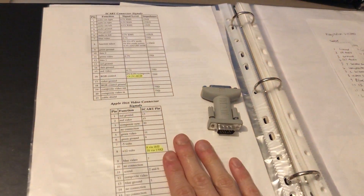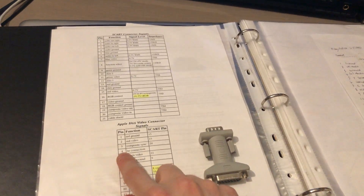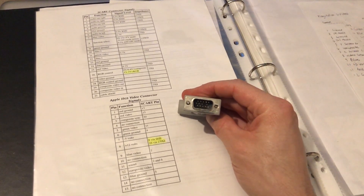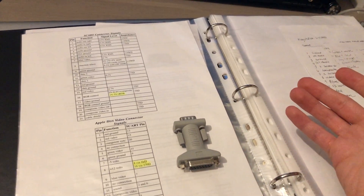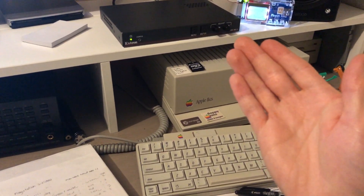The first thing that got me thinking about this was the SCART pinout. This adapter will take the unusual composite sync on pin 3 to horizontal sync pin 13 on the VGA side — perfect for using 15 kilohertz VGA monitors or scalers that take VGA at 15 kilohertz.